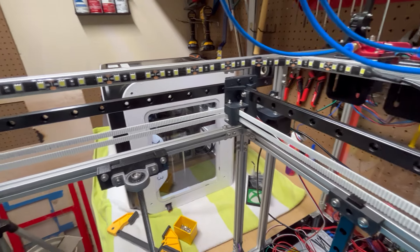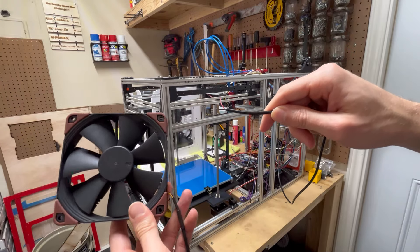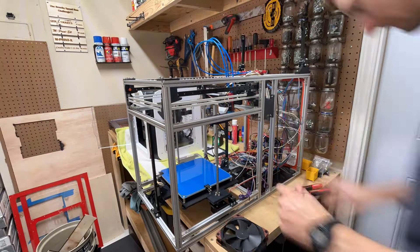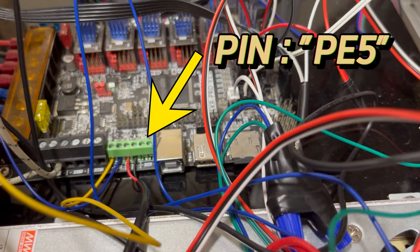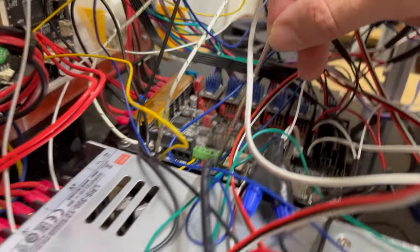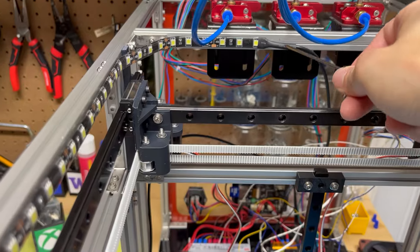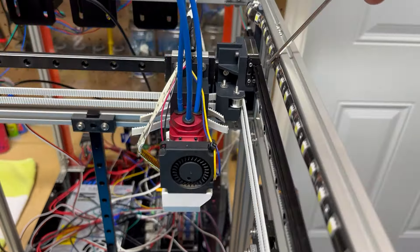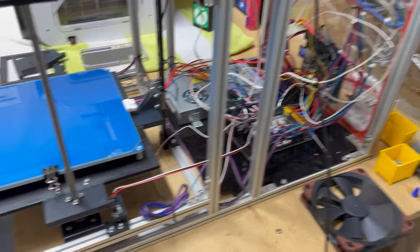Installing the LED light strip was pretty easy. I was going to 3D print a whole mount to hold the lights, but for now I just stuck them to the top of a bit of extrusion. Since I had the LED strip open, I went ahead and connected the cooling fan that would cool my drivers to it as well. The LED has a red positive wire and a black negative, all connecting to the fan 1 slot on the board. This current goes from the fan 1 pin to light up the LEDs across the top aluminum extrusion, and then goes on to spin the fan above the electronics to cool the drivers.